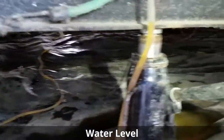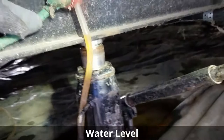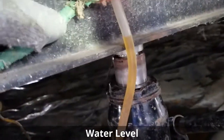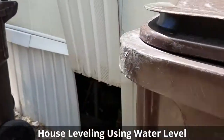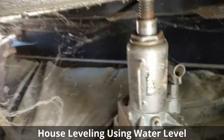We just go through with the water leveler and get all our I-beams level, and we tighten up the stands as we go through. This needs to come up about a little over a quarter inch more before we're level. We just go through and do the same thing throughout the entire double-wide, making sure all the beams are level with the water leveler.